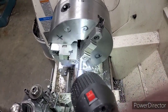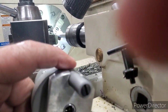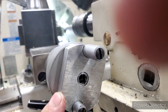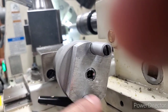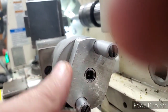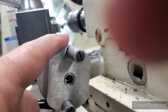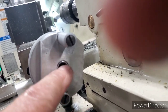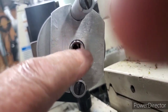I promised y'all a look at this apparatus. I just drilled and got me a piece of aluminum the same size as this. I had a piece left over and I put a hole in it, then I turned it on the lathe. It was already this width, and I had a stud and put it on the lathe and turned this diameter to match. Then I opened this hole up and pressed it.